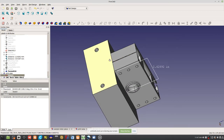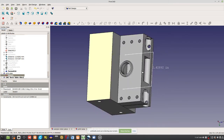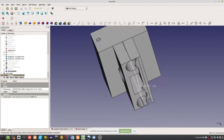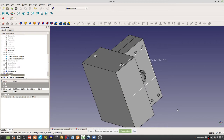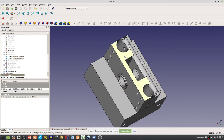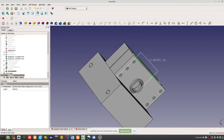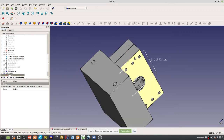So that you can put a binding piece, like a T-shaped bonding piece, to these two pieces. That's another way to do it. I mean, the geometry here is, you've got to attach the two pieces. If you can't attach it within the pieces themselves, because for example we're tight on space on this side, on this back side here, we might have to use another means to attach it using connector pieces. That's viable. You can easily 3D print connector pieces if we don't build in the means of attachment to the pieces right here.